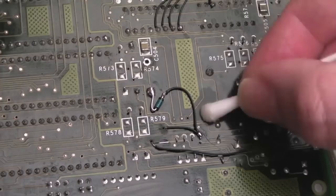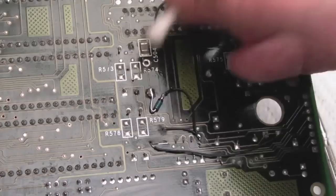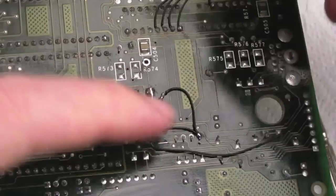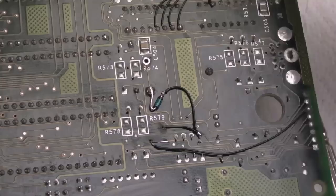So I'll get a new battery in, and I'm going to go test it and see what's going on with the voltage levels there now. Hopefully, when the system's off, the battery will be powering this chip. We'll see 3 volts there. Because what was happening before, I don't know if I mentioned, it was like 0.4 of a volt when the power was off, because obviously it was trying to power the whole system. Now, I know that diode's okay, so I'm curious as to where I joined it up. I must have joined it up completely to the wrong place.